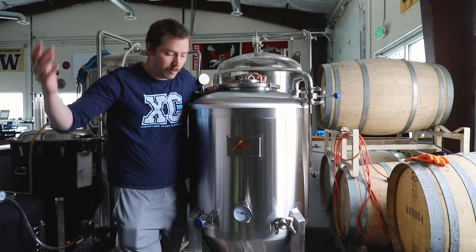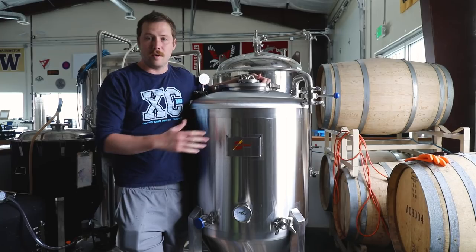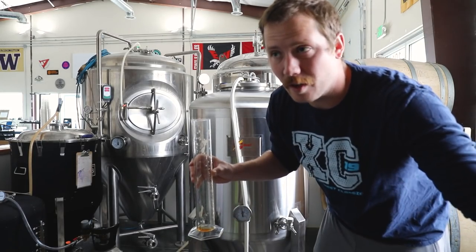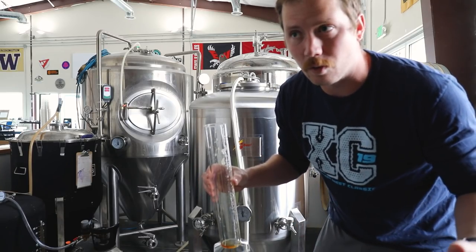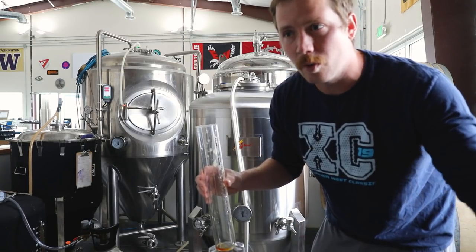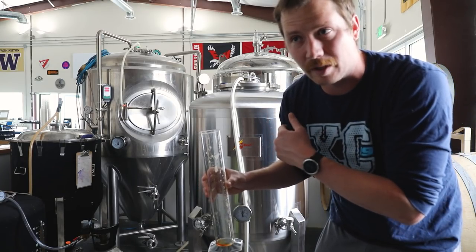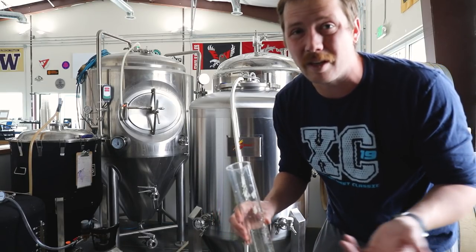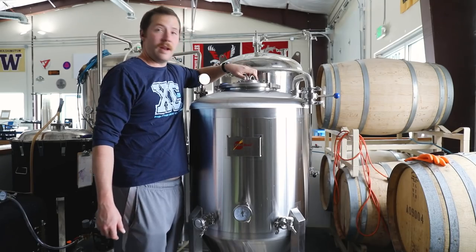So that's the breakdown of all the utility that comes with this tank. All we have left to do is clean and passivate it and get it ready to use. One thing I'm realizing while filling this with caustic is that you will not be able to CIP with the reaction chilling rod in place. The chilling rod will have to be cleaned by hand every single time, which is a net negative compared to a jacket. But at the same time, it's really not that big of a deal — for the price, it should still be pretty functional.